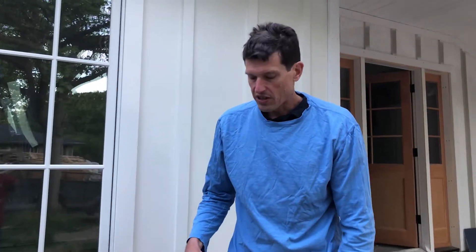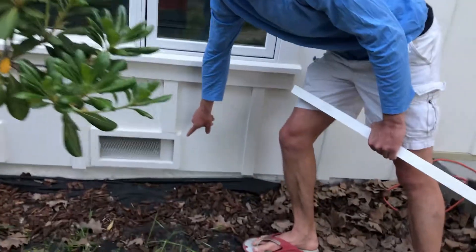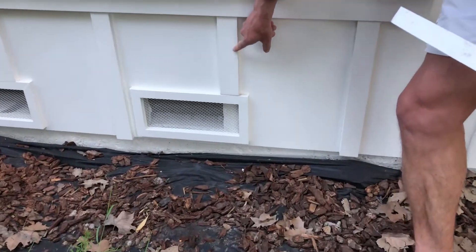The next step is to choose the width of the material. We chose one and a quarter inches, which is exactly half the width of the batten, and it looks really good. Make sure you select your width before you buy it, because you can have a lumber yard rip down the material to size — which is what we didn't do, so we had to table saw and rip down the material ourselves.